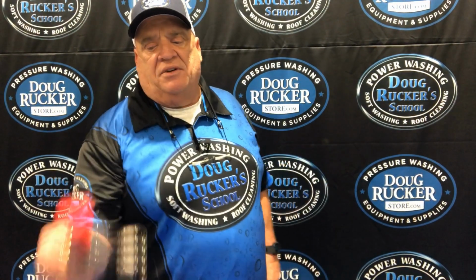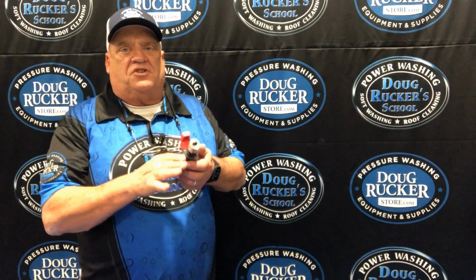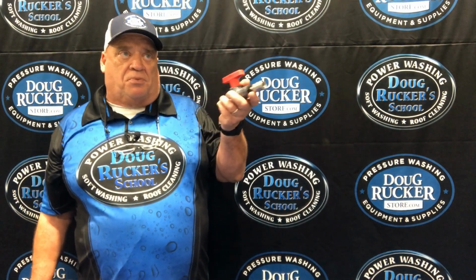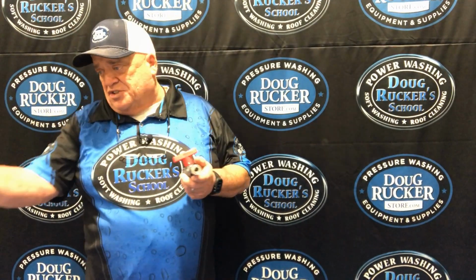But one of the things I wanted to explain to you about the ball valve gun is you have to be very careful. Most people, when they first start out with a ball valve gun like this and they're spraying and they want to turn it off, will bring the ball valve over to their hand to turn it off. And so what's happening is it's still spraying. You could be coming across the wall through some bushes or whatever, still spraying across a window.